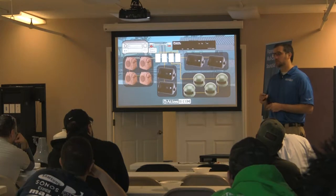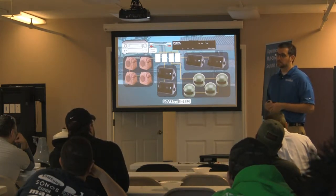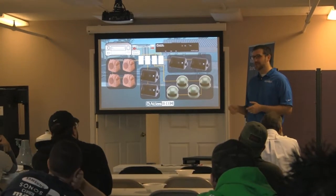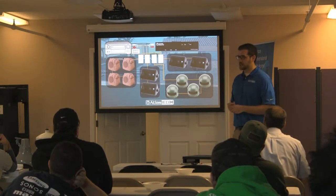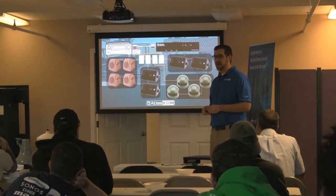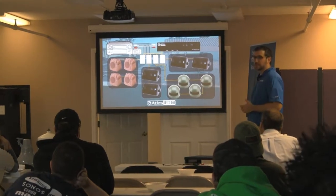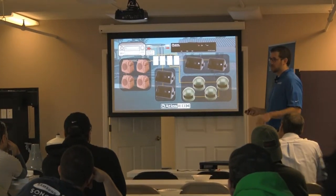The 80% is a guideline, not a rule. You could theoretically do 100 watts on a 100-watt amp, but customers are unreliable on what they're going to do with the gain. With the 80% rule, you give yourself headroom in case somebody gets past your security covers and turns that volume up — which never happens, customers never touch equipment. So backyard: real simple, real easy — four zones, one amplifier, four volume controls, cover the whole thing.